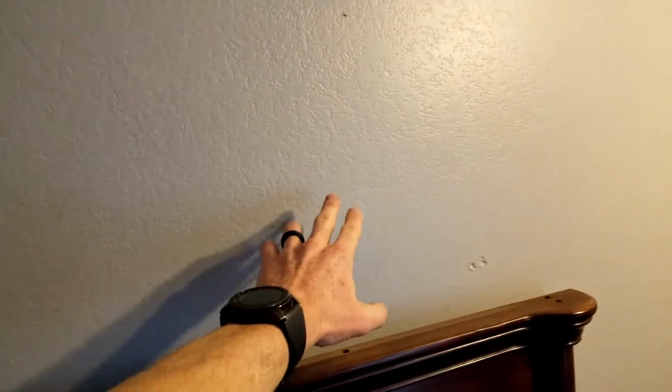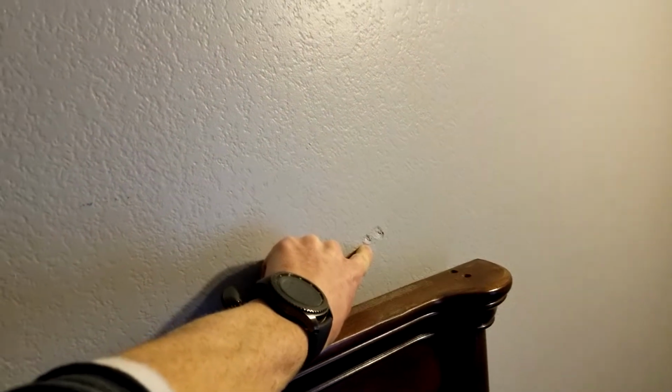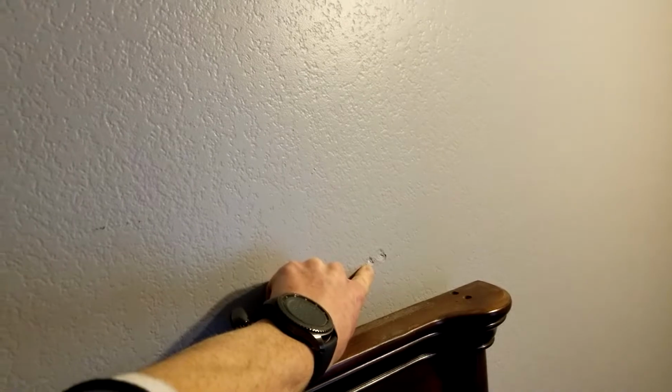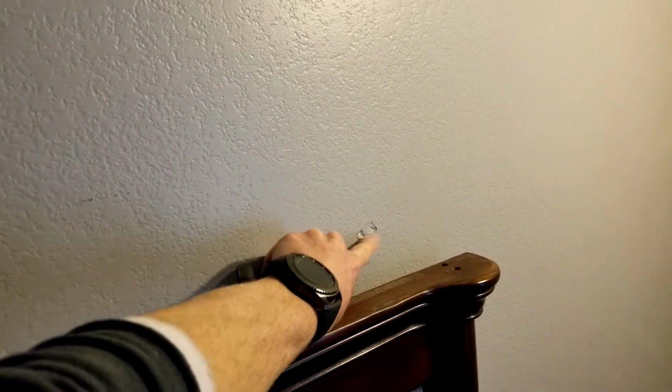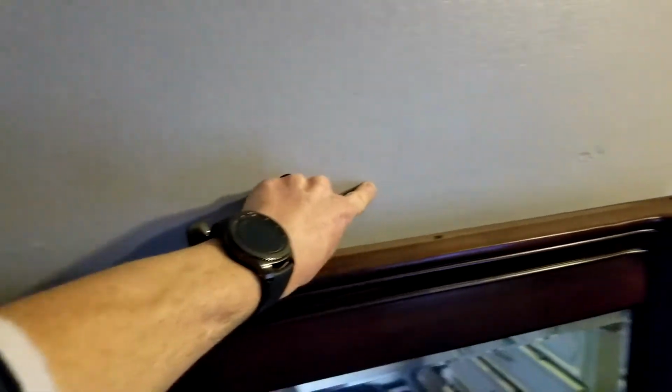But then once you do find one stud, then with a stud finder, try to go within maybe 16, 17 inches. Now, ours, unfortunately, are 2 feet apart. We have an older home built in about 1990 era or so. And so we have the previous owners actually kind of spot checked us here. So we measured it and we're about 2 feet away or so from each other.